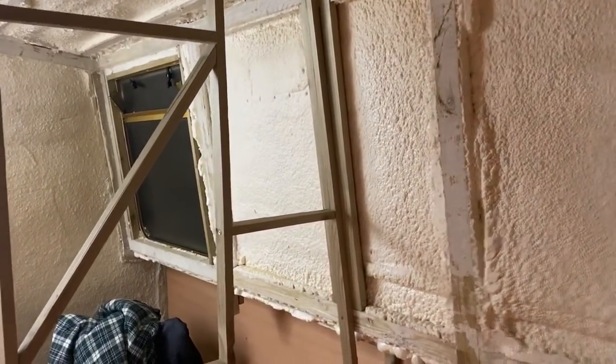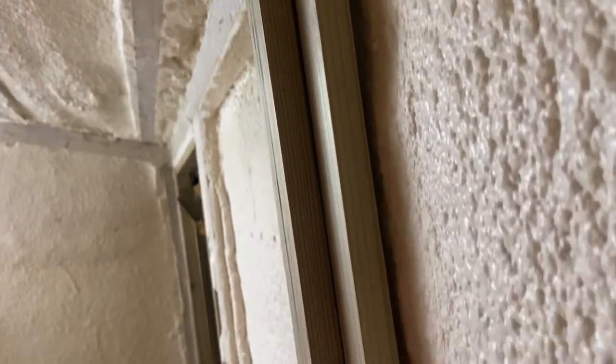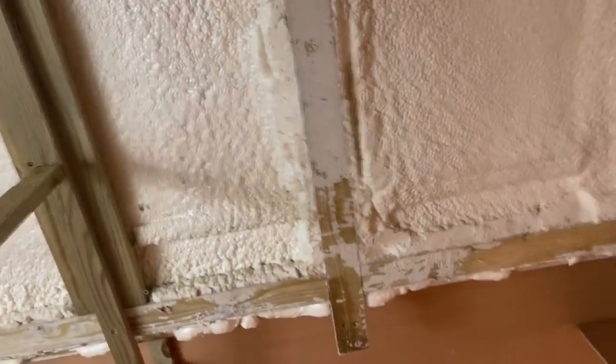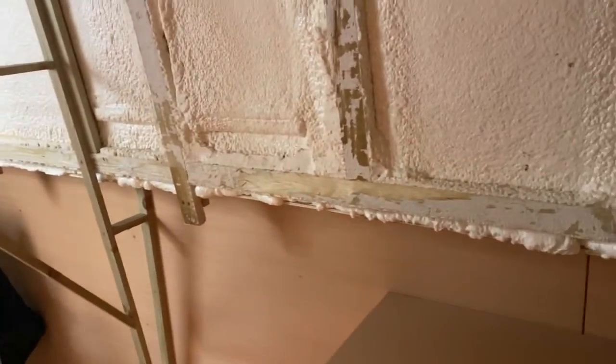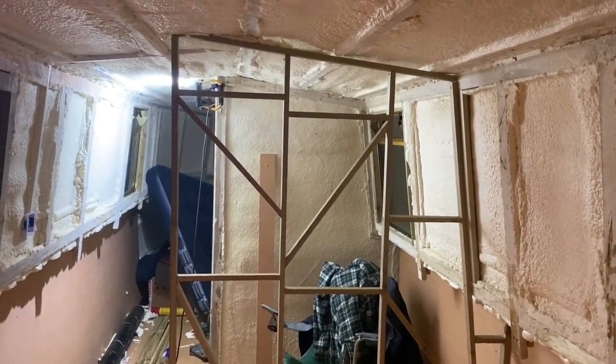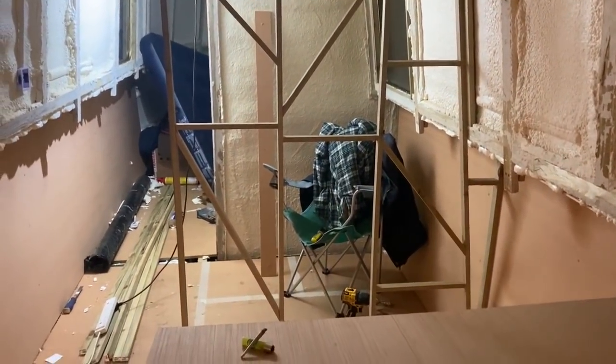As you can see, I've put in a batten on this side here, so it's inside the wall. When this sheet comes up to here, obviously it can be affixed to the top and to the bottom, but it can also be affixed to the side here. And I've done the same on the other side. So now this is what the frame looks like — I've got those extra batten pieces on the side, and I've put one, two, three, four diagonals in.